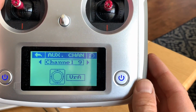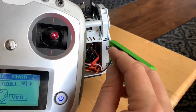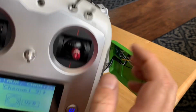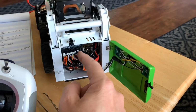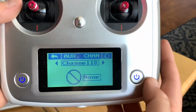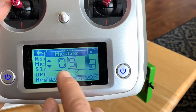The limiting factors are your 1, 2, 3, and 4, which are your analog switches for your gimbals on the sticks. Now here I'm assigning my channel for my opening and closing on the bucket. There I want to put that on channel 10, and assign it to that switch on the top of the radio.